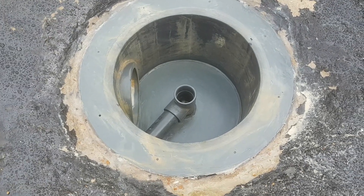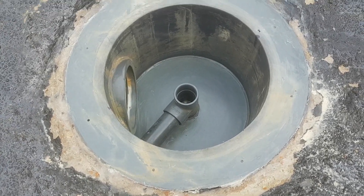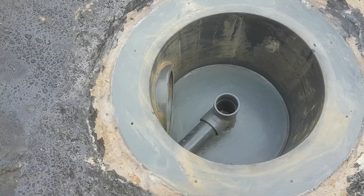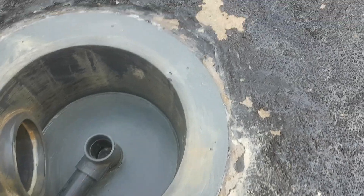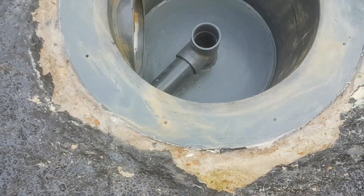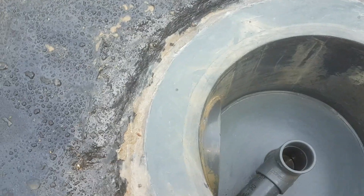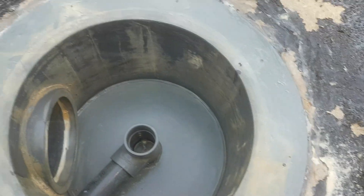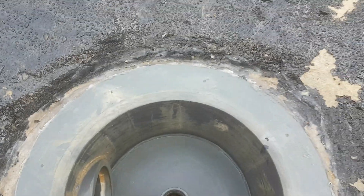Finally I took off all the plastic around the bottom drain, peeled back a little bit of the G4, put some sealant right around it. When that's dried I'm going to bring a little layer of waterproof cement over the top, and when that's dried I'll do a G4 again — then it's ready for fibreglassing.